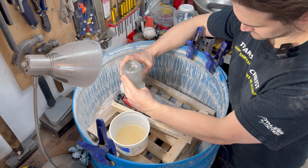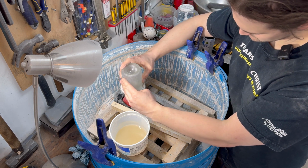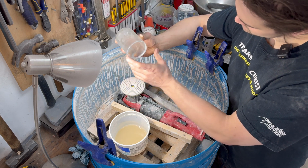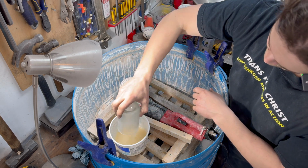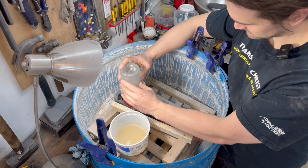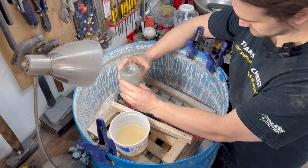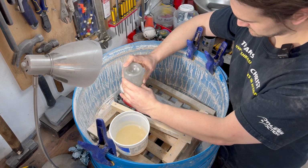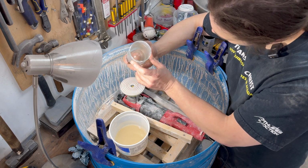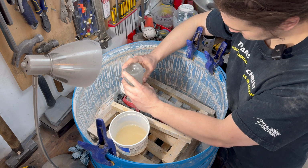These diamond pads retain the abrasive, they don't shed it, or at least they don't shed it very quickly, and they're lubricated with water. This cuts much faster without the risk of chipping. Something else cool about these pads is if you do not have a polisher but have a random orbital sander, these are Velcro back. They will stick to the random orbital. I have not tried that. I have a polisher and this seems to work very well.